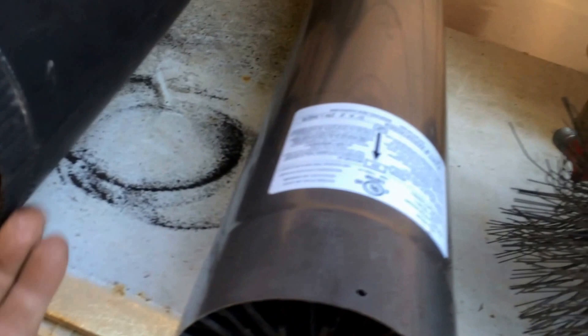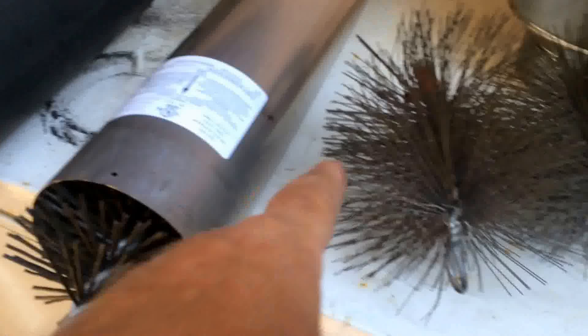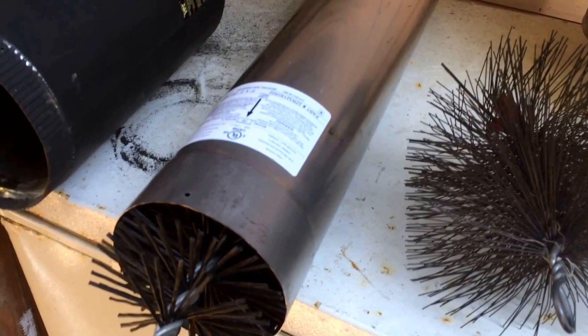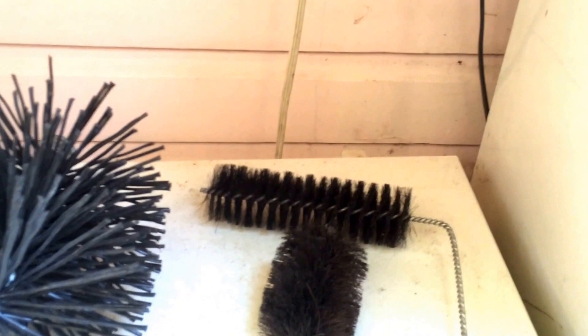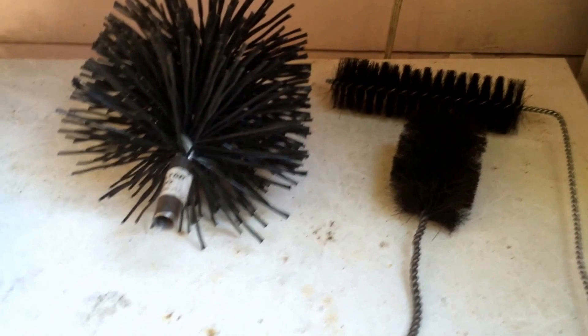So that's the ideal thing. And again, it replaces all of these. It works beautifully in that pipe as well, because when that pipe's installed it usually has elbows on it — it'll get those stuck. We use it to replace these as well, because you just spin that on top of the smoke shelf, and it creates a big dust cloud that we suck up with the vacuum cleaner. So that's the evolution of chimney sweeping — from all these brushes to this one simple little approach to life, and it makes things so safe and easy to do.